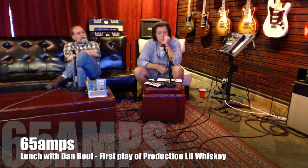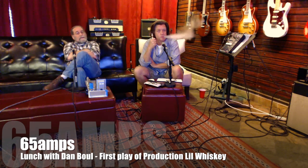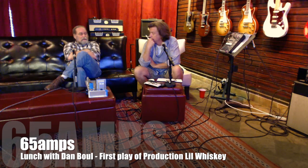I have an amp that Carl Verheyen used to use a lot that I built that was over 400 volts on the plate and the screens for 6V6s. The only tubes that'll run in that amp, it's cathode biased, and they have to be NOS, and they last like about 5 to 10 hours before they blow up.